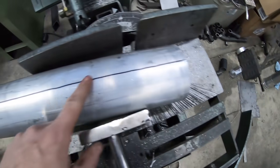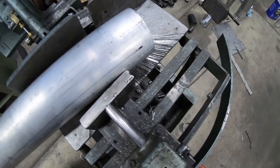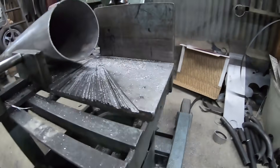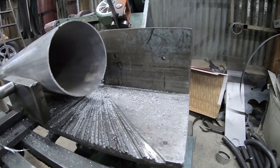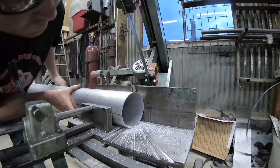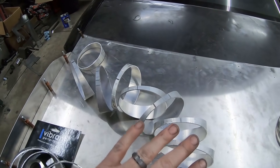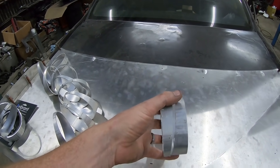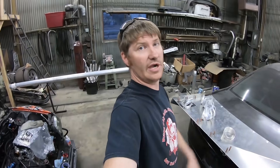The other thing I do is draw a line down it — it's not 100% square but it's just a reference point for indexing. I also made one about 180 degrees out on the other side, because I have to keep reversing the pipe 180 degrees. I make those pies facing inwards to make it like a slice of pie — otherwise it's just going to be like a parallelogram or something. Just got done cutting those all up — eight dedicated for the boost pipe bend, two for the exhaust, and two that have a seven-and-a-half degree and then a straight. That should be enough. It's getting late but that's a good start.